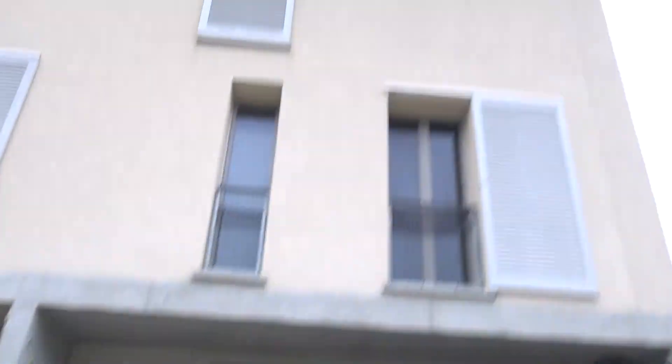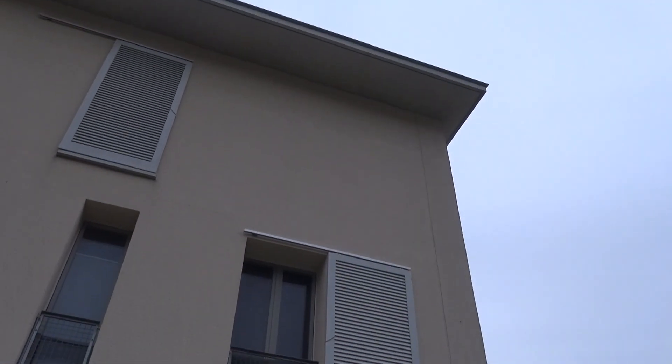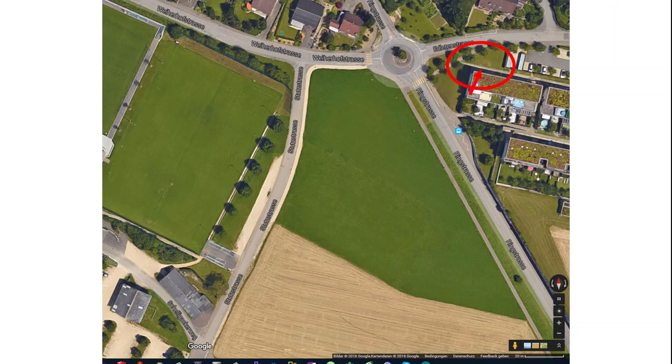Another example: the ESP12E was not capable to connect to the iPad when I was standing 20 meters away but behind the house. This is also a proof that waves in the 2.4 GHz band behave much like light waves — they work well if the sender and the receiver have a line-of-sight connection and do not work at all if this sight is blocked.